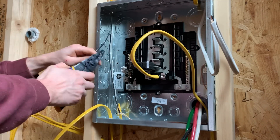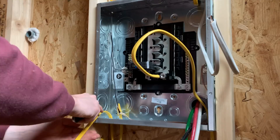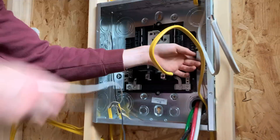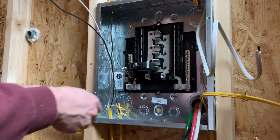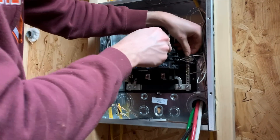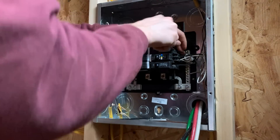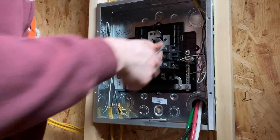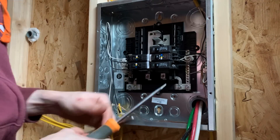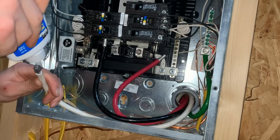Lastly, I'm taking the black wire from our circuit and connecting it to the back of this new breaker. Now I'm just repeating those steps for the other four circuits that are going to be in this panel. Later I'm going to be installing another GFCI 20 amp breaker to supply our mini split system — I'll cover this more in the next video since that's dedicated to finishing out the interior of the workshop. All of the outlet circuits in this panel are going to be GFCI protected. The 15 amp breaker on the top right feeds our lights, but there's also another non-GFCI breaker in the bottom right. This breaker supplies the exterior outlet along with that one outlet on the interior. We're able to get away with a standard breaker here because the first component in that circuit is a GFCI outlet, which means all downstream outlets on that same circuit are considered GFCI protected.